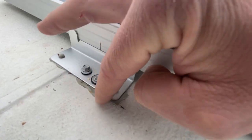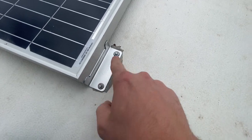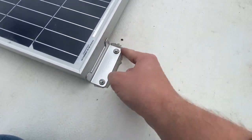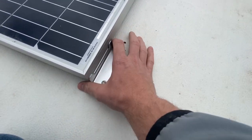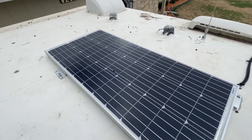That's why I went ahead and got this done last night. That way this could all squish out, and that's what it did. I had all this cleaned up last night, but it went ahead and pushed out, so I'm going to go ahead and trim it up nice and clean, place the lap sealant on there, and that'll prevent leaks from happening in the ceiling.